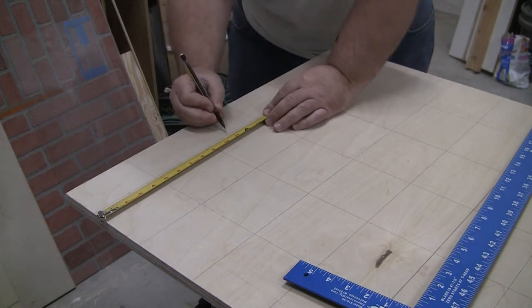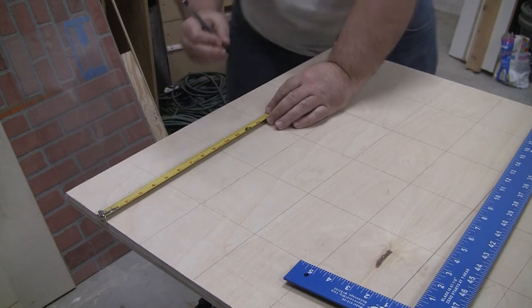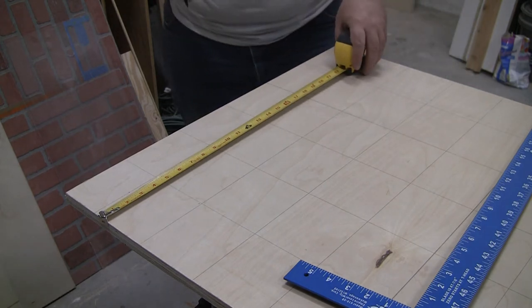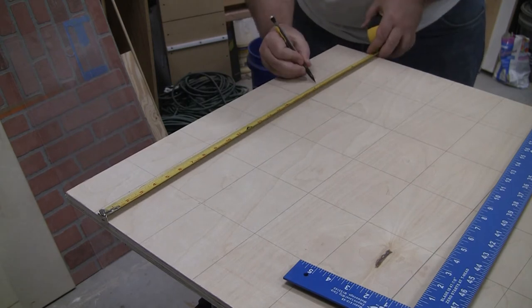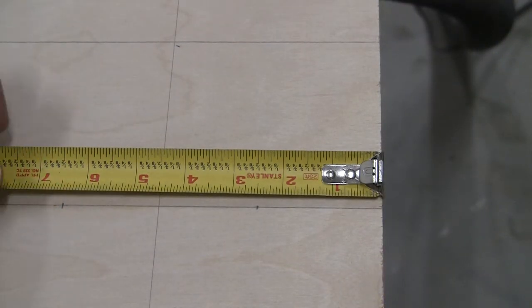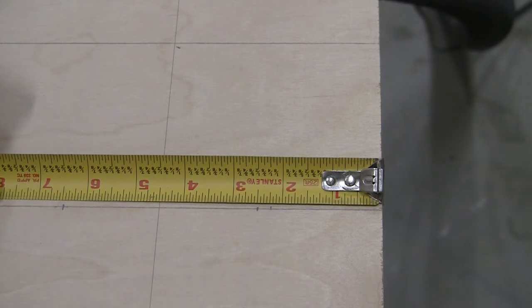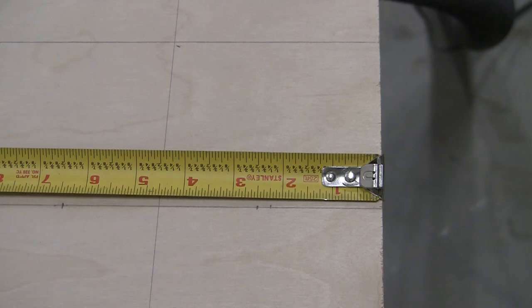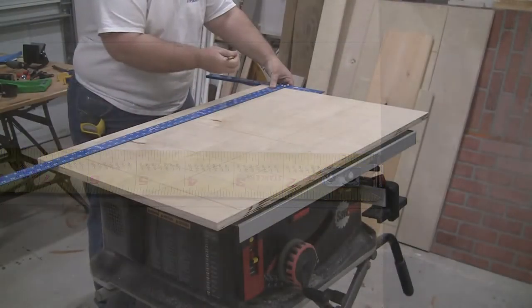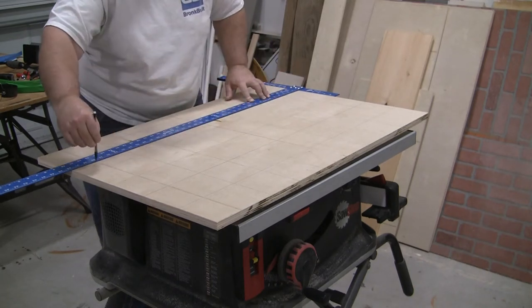You want to make sure that these are pretty accurate. Each row of pegs will be shifted to fall in the middle of the row above and below it — this is what gets the disc bouncing around. So we now need to make a mark in the middle of each slot across the bottom of the board. Measure twice, cut once. I mistakenly marked the middle at 2-1/2 inches when it should have been 2-1/4 inches. I will re-mark them all. I'm glad I caught it now — math is hard. Using my T-square once again, I fill in the lines for those now correctly marked halfway points.